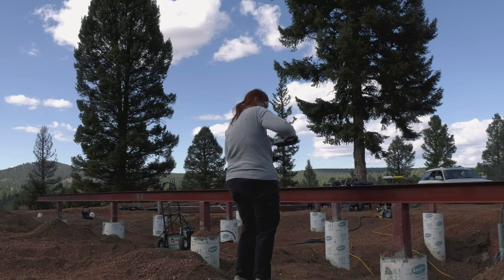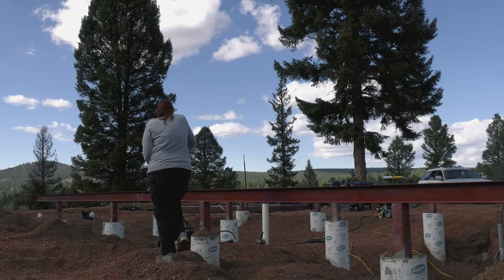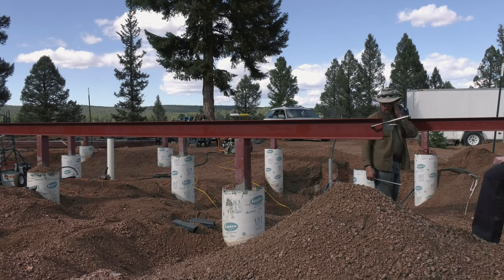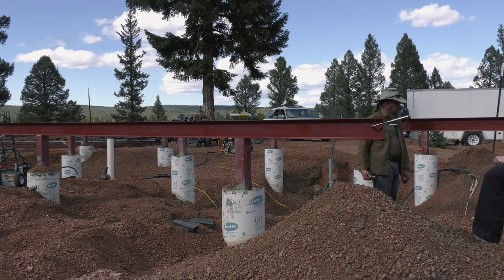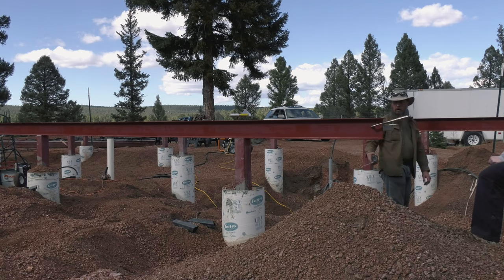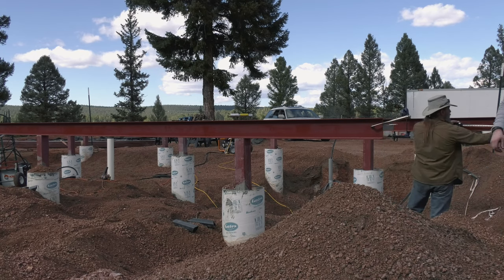The plan is to measure four feet from the center back here, and the other end ends up being about six feet to the center. I'll throw a string off that end so these other two ends are square to it, because these are not necessarily in a perfect line. The beams should be good if anything — very smart, Mike Iver, ladies and gentlemen.